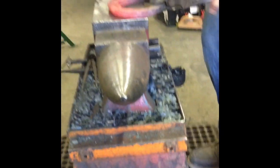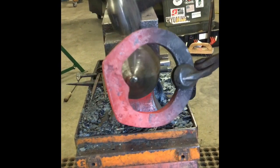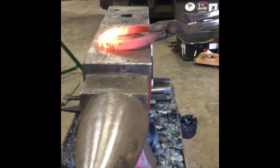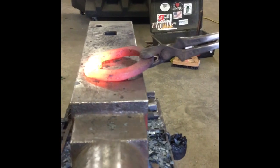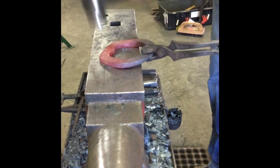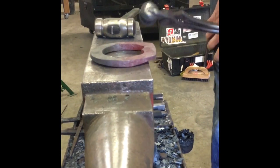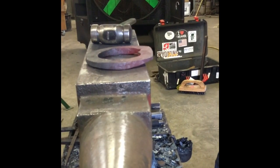I'll come back on the horn and tighten everything up, then push that frog plate and really make it nice and tight and tidy. You can see I'm really pulling on my tongs to get that frog plate in the center — I'm really lifting up and going down to the corner. I've got the back half, just trying to get it as flat as I can, lifting up on it. Now I'll do the front half. You can see it's already starting to rock — as long as I stay true to the two points it'll come out normal.